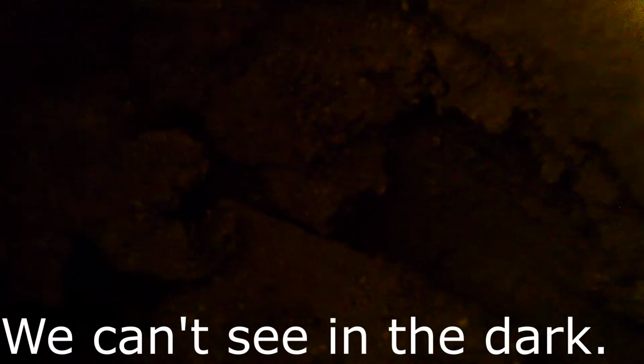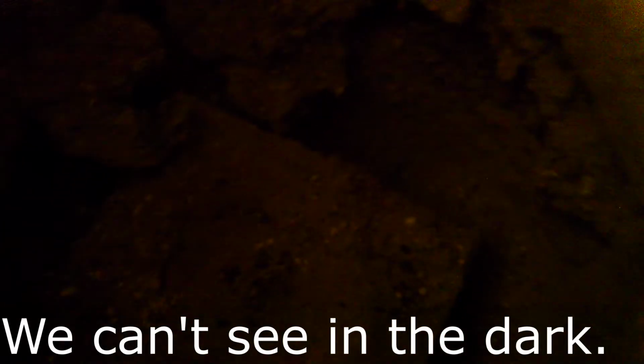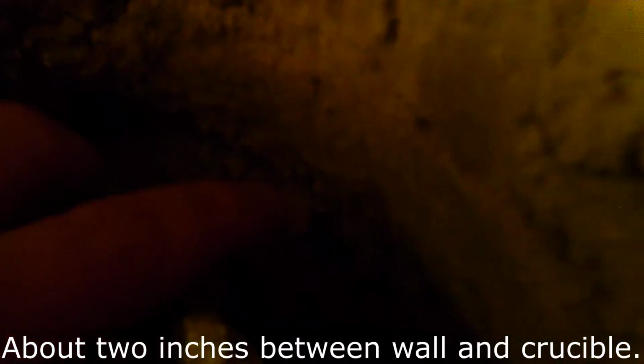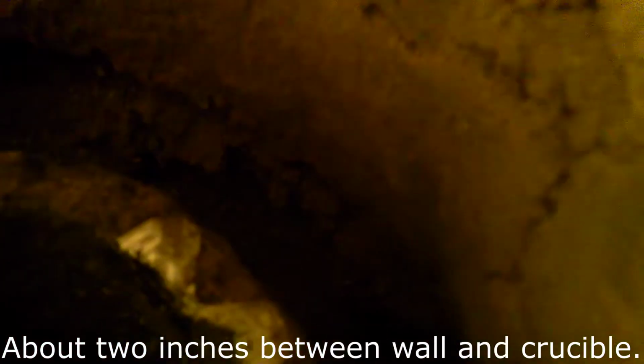Let's look at that. As you can tell, I've done some firings on it, and it does get very noticeably hotter. So I'm going to be doing some modifications on it. And yes, that's fire brick down there. And I'm sliding that crucible down in there. As you can tell, I've got a lot more room. I could actually use regular charcoal briquettes, and it works out decently well. And does this thing get hotter? Yes, it does.